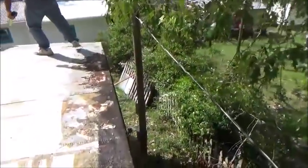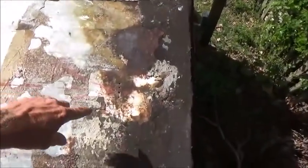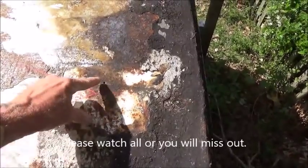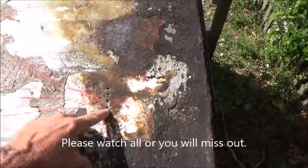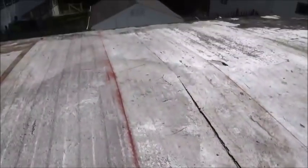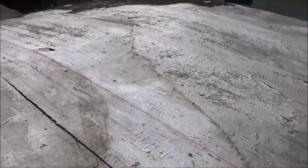Here's what we have Chris doing right now. The first thing we did — this is an important step — is find your rafters. We poked 4 holes there because we wanted to make sure we found each side, then we pop a line dead center, and that goes all the way across. We pop those lines every 2 feet, or wherever there's a rafter.